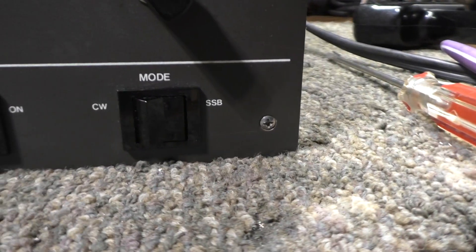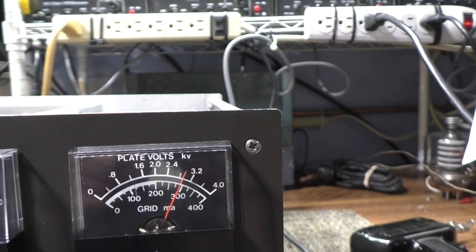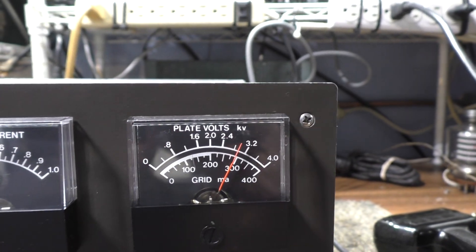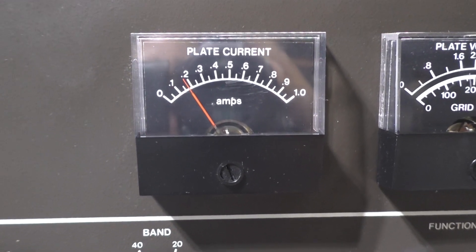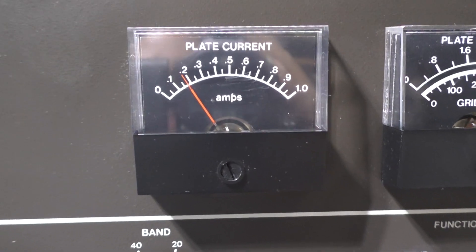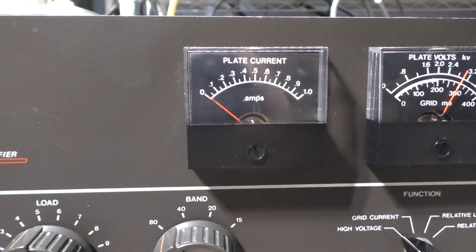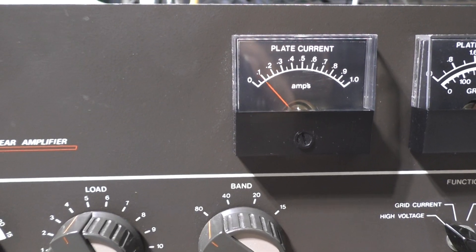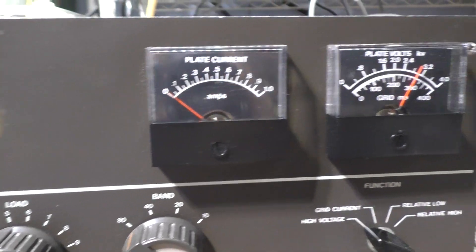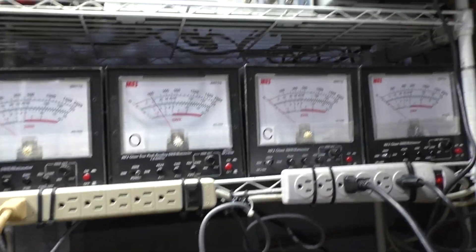Going to unkey and key the foot switch. That's the high voltage — we're on the high side, which is SSB; CW would be the low side. With the foot switch keyed down, it's doing about 3 kilovolts high voltage. Keying it down with no drive, that's the plate current with no drive. With the bias, originally until they came out with the Harbach and other mods to up the bias a little bit, when you keyed it down with no drive it would be sucking out a whole lot more power. Modern thinking upped the bias a little to tame that down.